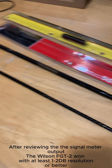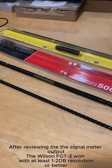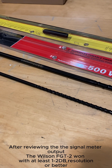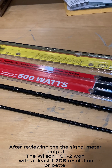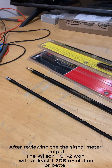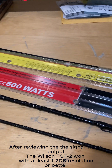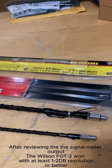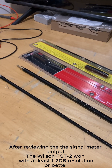Serial Performer 5000. With the length the same and nothing but the diameter and gauge of the windings different, these antennas are pretty close. You have to look pretty close at the display. I don't have a proper high-resolution S meter, but I will try to calculate the gains based on what we saw.